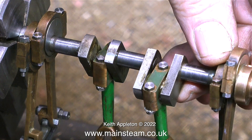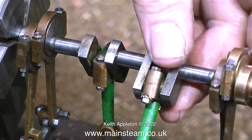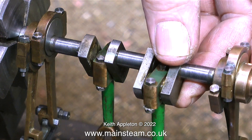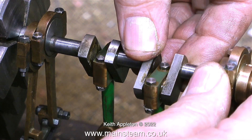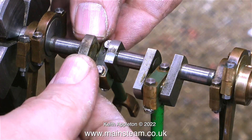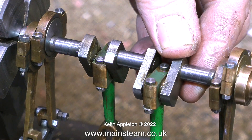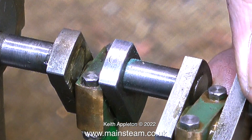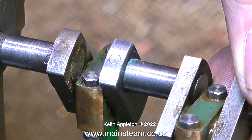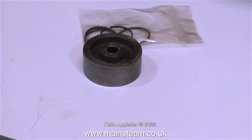Really, if the engine were all clamped together you may not notice this, as it's a small problem — but it's not right. You would get a knock from the engine every time it goes over top dead center. The fix is to drill out the pin, re-Loctite the crankshaft together whilst holding it in the lathe, then re-pin it with a larger diameter pin. This pin is very sloppy — no good at all.